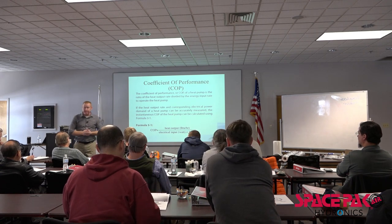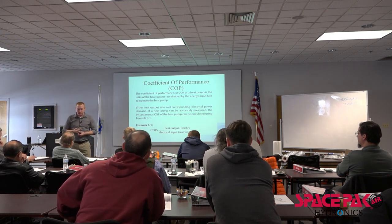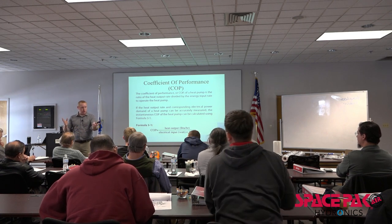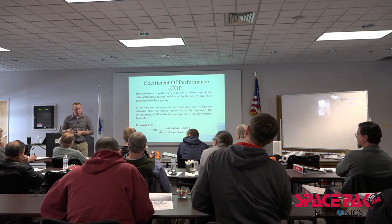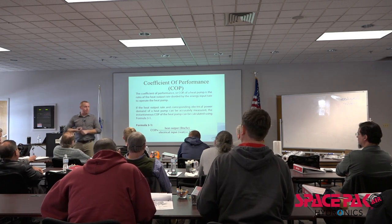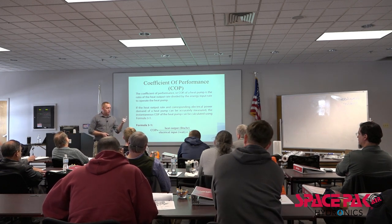You're the machine. A COP of one, you give me $1 of energy back, right? If a COP of 2.5 means I'm going to give you a dollar for heat, and you're going to give me $2.50 worth of heat back, okay?